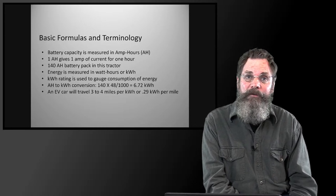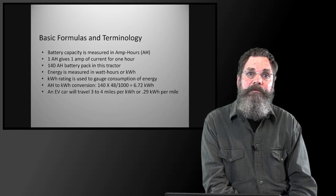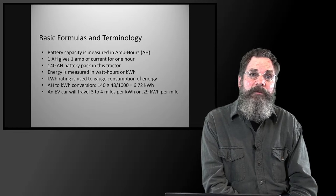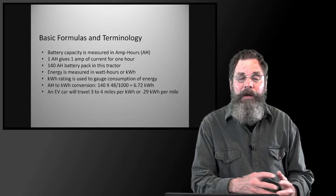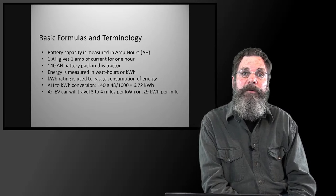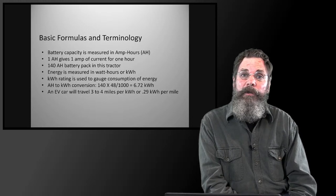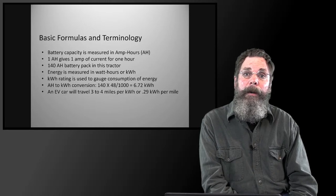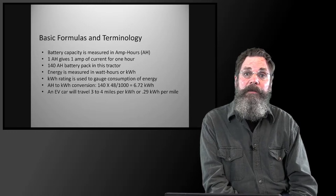The rows are right outside the barn, and we've got basically 1,000-foot rows, or pretty close to that, in one part of the farm that we can work. And so the idea is that there's actually a fuel gauge on the tractor, or I'm calling it a fuel gauge. It's a voltage meter that lets you know sort of state of charge. And by looking at that, depending on the kind of work you're doing, you can do so many hours of work and then you need to come back in and charge it.